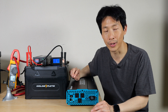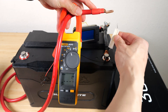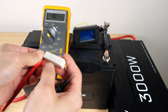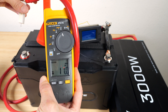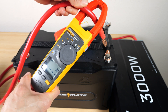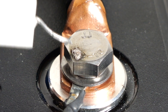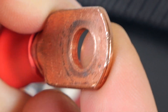That's enough testing from the external. Let's open it up and see what's inside. There's a bit of residual energy in here, so we have to discharge that. We can measure with the inrush function on this meter. 8.7 amps just flowed through instantaneously — the resistor value on this is pretty low, about 0.1 ohms. Now that it's discharged, I can check the inrush current when I reconnect the battery — 11 amps. Now let's try without the pre-charge resistor to limit the current. It's going to spark with no discharge resistor. It still says only 11 amps, so the inrush might be too fast for this meter. Look at what happened to the bolt — it kind of melted a little from all that current, and the cable lug is charred a little bit.